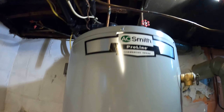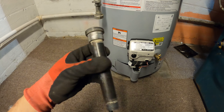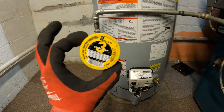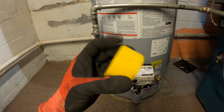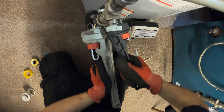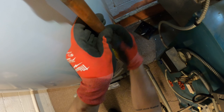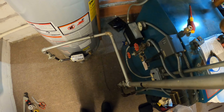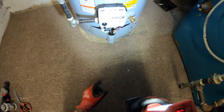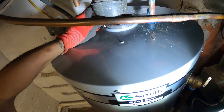I'm going to start with the gas line because the water I can manipulate a little more. This is kind of hard drawn pipe already set, and I just want to get this to fit. I do have this special Teflon – it is for gas lines, I like using this. I also got some blue thread tape, some Teflon tape for the relief. Let's thread that one on. The gas line looks fantastic. There's no floor drain so it is what it is. We have to install this cap.